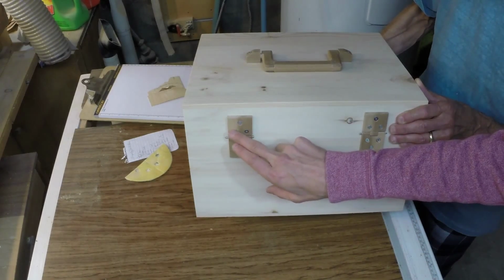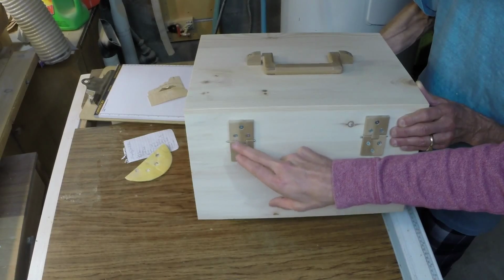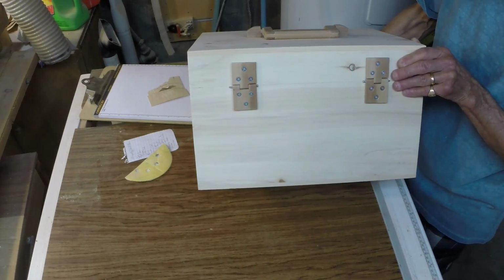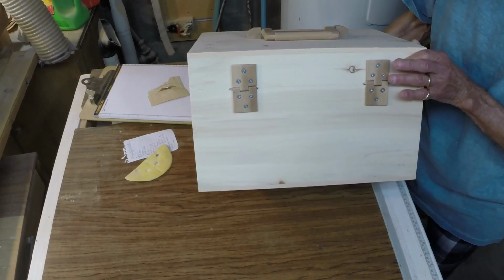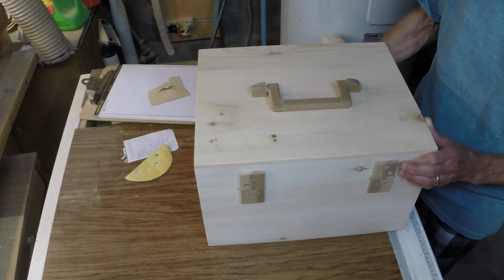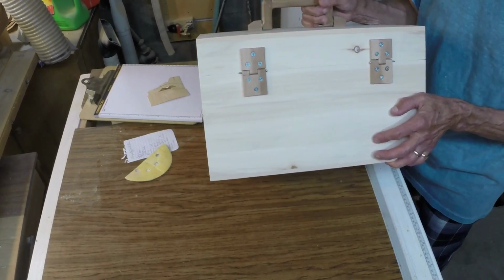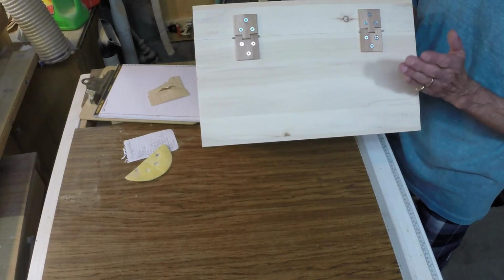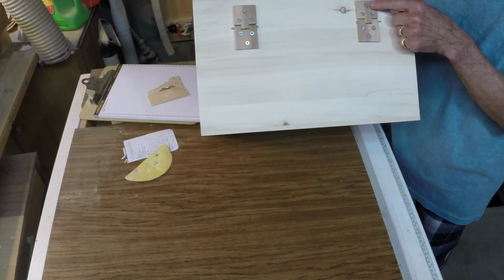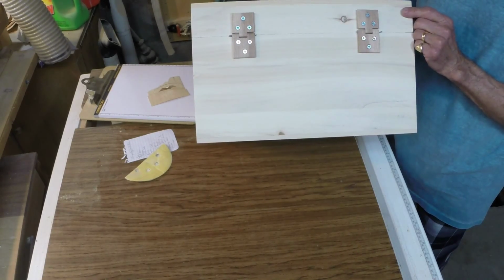Okay, so I can see here you're using standard screws. Correct. This is the cherry here, and then I can see the latch or the hinge detail here. What's in between? What's holding that together? Well, that's basically a system of dovetailing, even though it's more of a box joint type of cut, but it has to be cut precisely. So when you hold it together to drill the hole for the actual hinge, which is a simple nail, you have to make sure the joint here is precise, and that's generally done with a dovetail saw. Ideally, it would be better if this was just glued on, which you could do as well, but because of time, I decided to go with the screws.